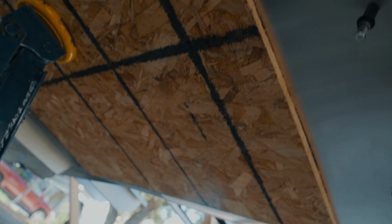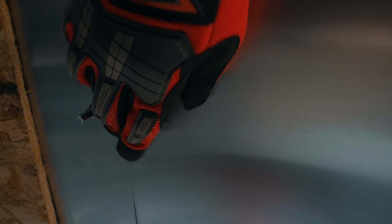So I took this sheet of aluminum, which is the very next piece, and here's the very back piece. I overlapped it by an inch, which is the width of the frame cross member that I'm riveting into. That way I could just drill through both sheets and use one rivet. And again, make sure that you're overlapping, so you want this lip to face the back.